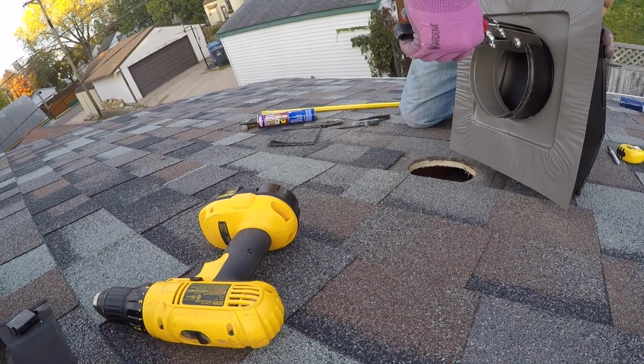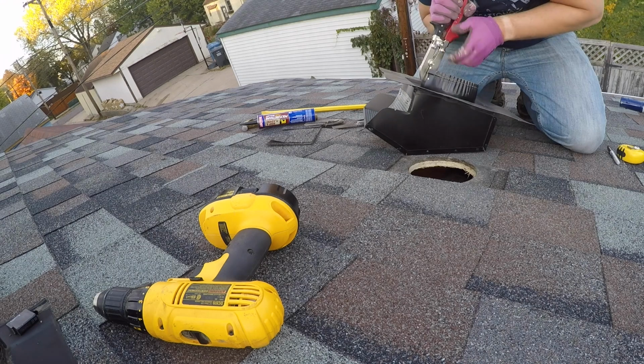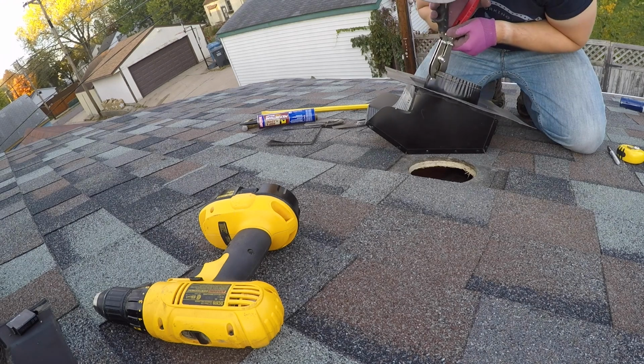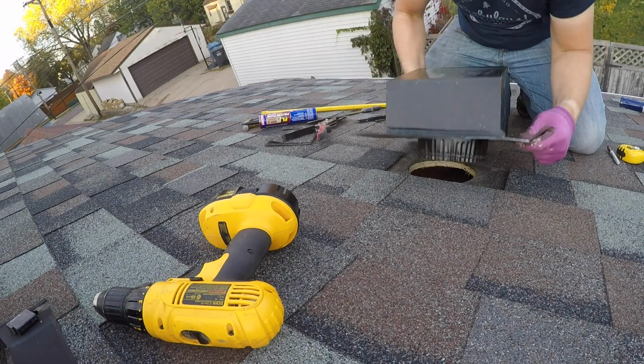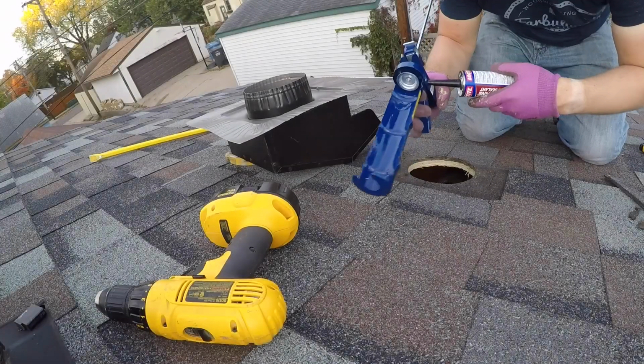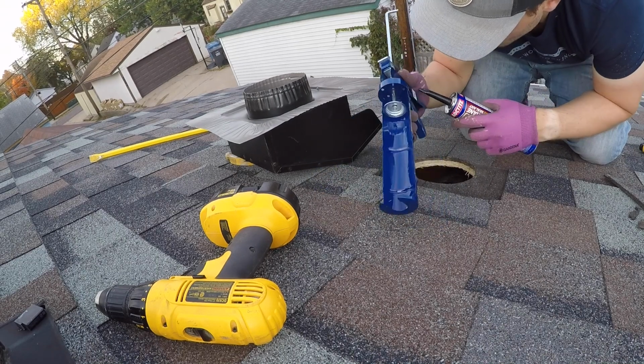So I used a ductwork crimping tool all around the perimeter, bringing it down in size a little bit. This crimped edge will connect to an uncrimped piece on the inside of the garage. After it was crimped, I could do another test fit and found that it now fit in the hole just fine. Next up, sealant.